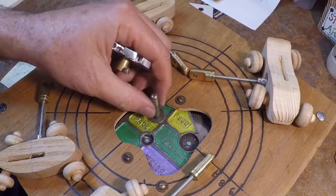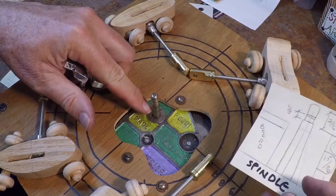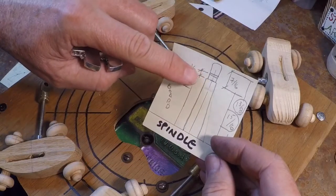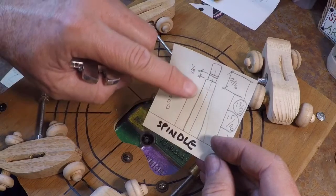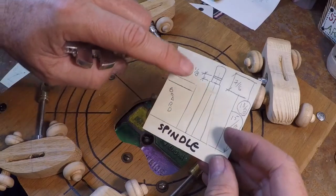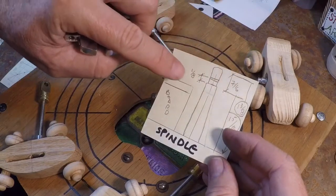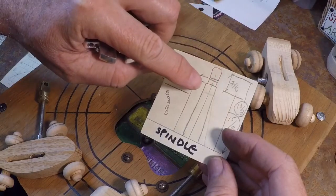This is the spindle that would drive your turntable for the gramophone, and here's a little sketch of what it looks like. The bottom part is tapered, and that's where the turntable disc actually sits — it's got an interference fit there, so it locks onto that conical shaped piece of the spindle. We're really interfacing with this top half-inch to seven-sixteenths piece — the peg that the record hole would go over.